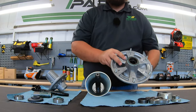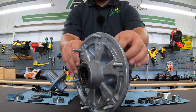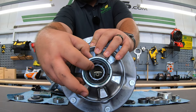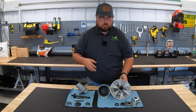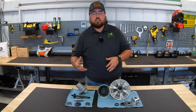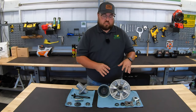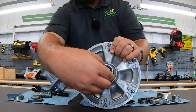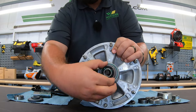On the Z900 or upper series spindle, not every internal component was taken out. On these upper end spindles, we have a grease seal, then another grease seal, and then a bearing behind that, with the inner liner or bushing still inside. I didn't pull those grease seals out because removing them can cause damage — normally you'd only get inside these housings when a bearing has gone out or a shaft has gone bad. The bearing from the smaller unit would fit way inside the larger housing, illustrating the significant size difference.